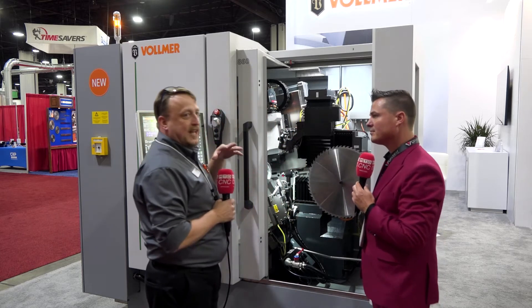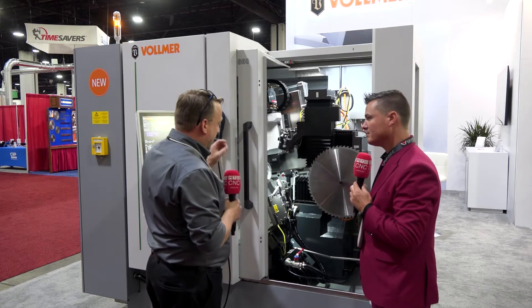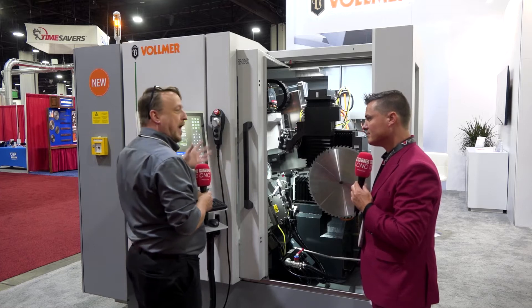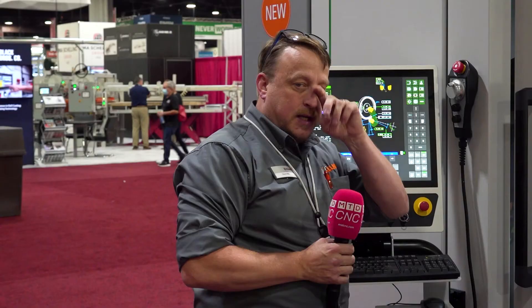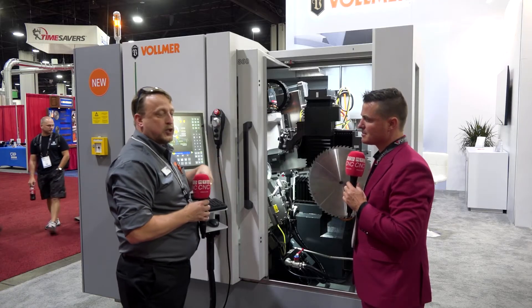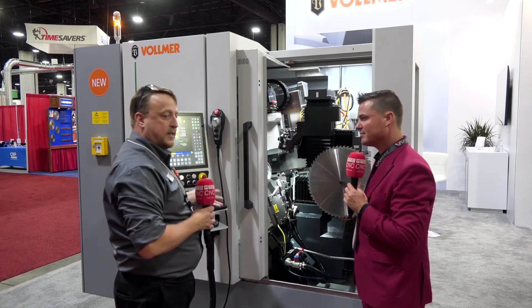What that does is give you the best possible solution to how much you want to take off for stock removal and for measuring everything. So there's no mix-ups where the operator accidentally puts in the wrong angle, and now you have to do rework on the blade or the blade has been scrapped. On this machine they've put DC motors with absolute encoders, so there's no more referencing on startup — the machine remembers its position when it was turned off last, which makes movement much faster.